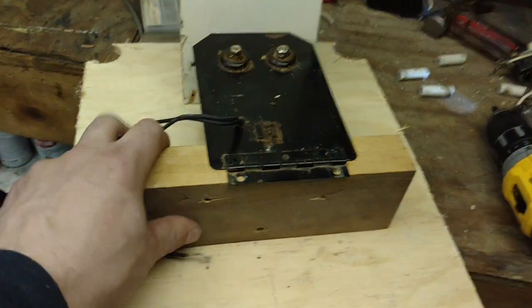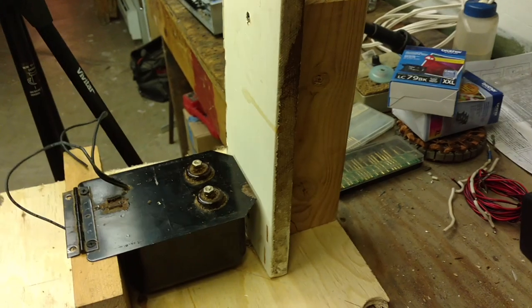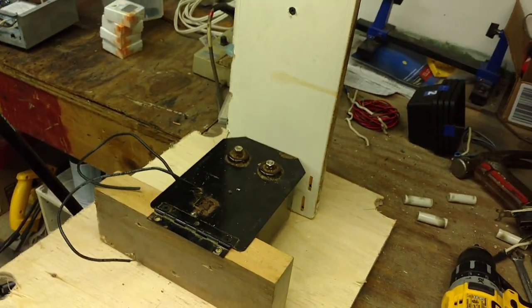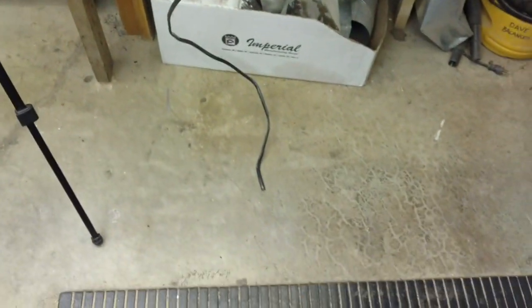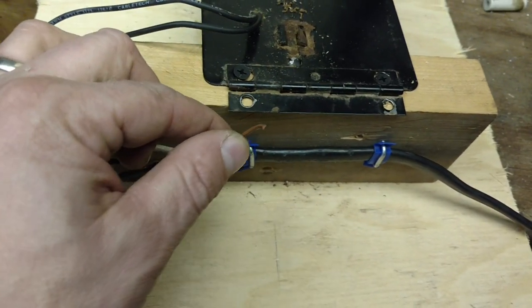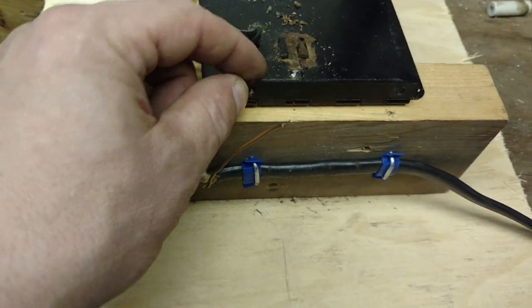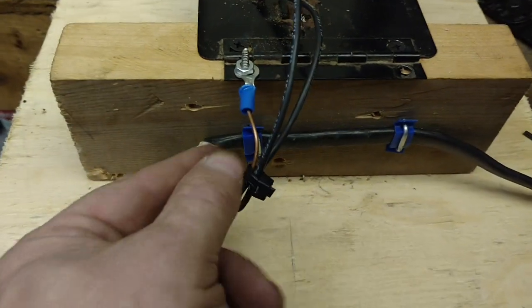Let's give it a try. This 2x3 block in the front — I've got the transformer screwed down to it. And I've got this nice board, I decided to put the white side out. It's screwed in with a little bracket, so it's plenty sturdy for our purposes. I fixed this nice long cord here — it's just a piece of Romex. My hot and neutral wires are going to connect to the primary side, and my ground I'm going to put an eyelet on and screw it to this flange to ground the metal case. And there we go — we'll ground it through this nut.